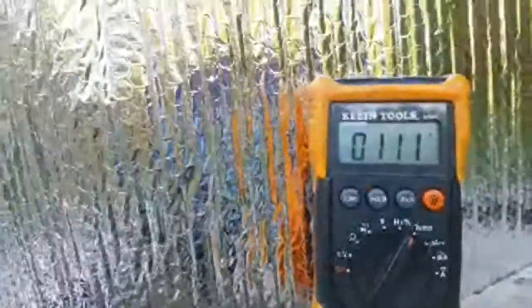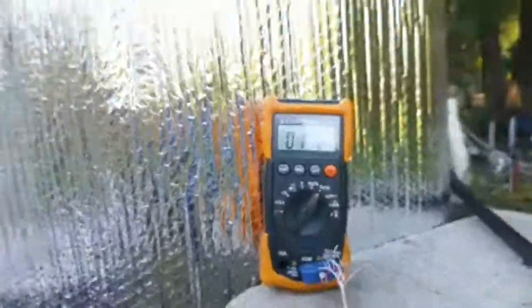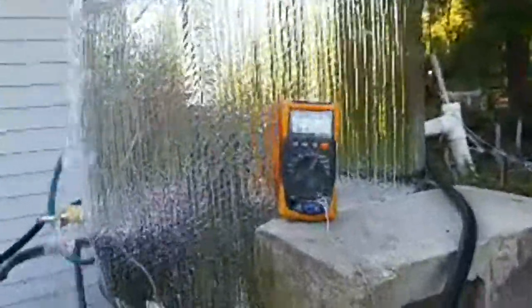But now that we've shut off the cold water supply, the top layer is still coming down, and as you can see, that's the hottest, and so it's rising. It went from 107 to 112. Depends on how much mixing there was. 113. Now it's draining. Now there's nothing else pushing from the bottom, so just the hot water is falling out.